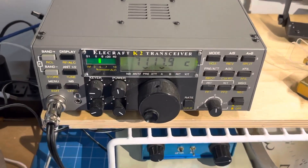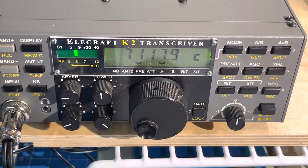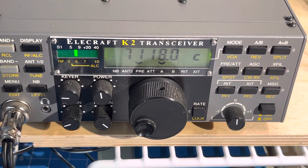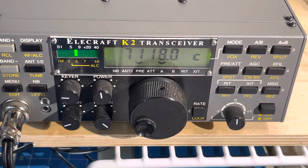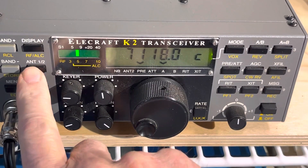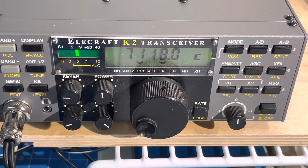So now you can see we can step things up here a little bit. We're connected to a piece of coax that goes to a 40-meter dipole laying on the roof. We're at 7.118 MHz and we've been listening a while — it's quiet — so we'll try the tune mechanism here. You can see ATU 1.1 to 1 and it stops. Let's see — if I switch away from through my tuner to just directly to the coax, you can try one more tune. It tuned up beautifully without using the tuner on the other end, straight through.